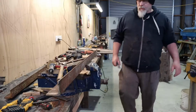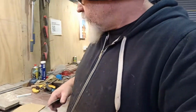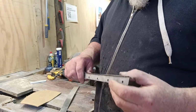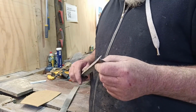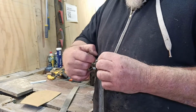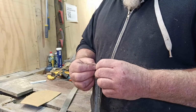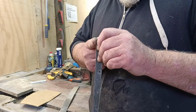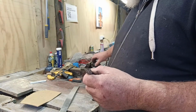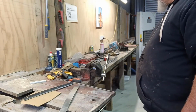So I'll carry on and first bend these last little pieces. These ones here will be the fun bits, these little in-betweens. Just to get that to squash down, but it should be okay. I should better double kick that at 45 and then bring that up to 90, and then instead of bringing this one to 90, just bring it as far over as I can. Then hopefully I should better squeeze it up, even if it's in the vise or something like that. Gently.